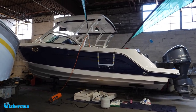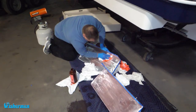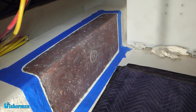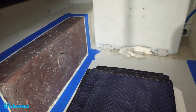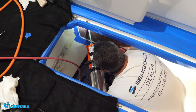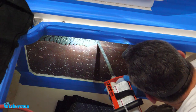Usually for us, we use aluminum fixtures crafted by Sound Marine, which is right here locally. We grind to accommodate it and then adhere it to the vessel. There's a base structure that the Sea Keeper unit will sit in. It's almost like installing a third engine — when people ask at boat shows, I say think of it as putting a new engine in the boat. It needs that same kind of structure.